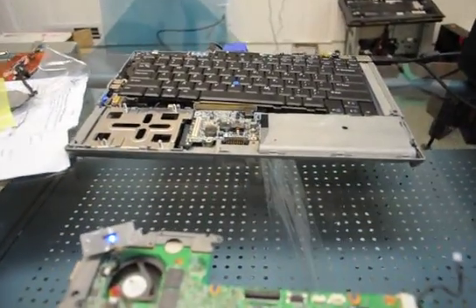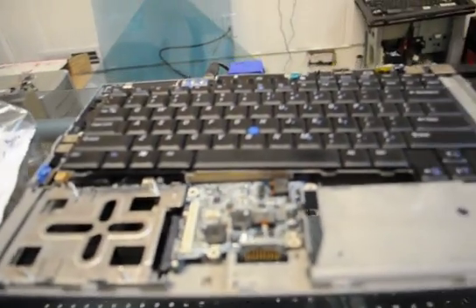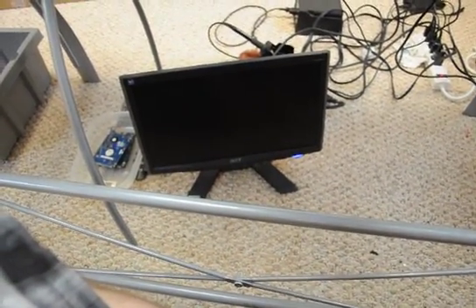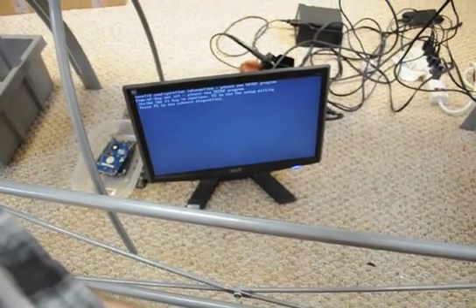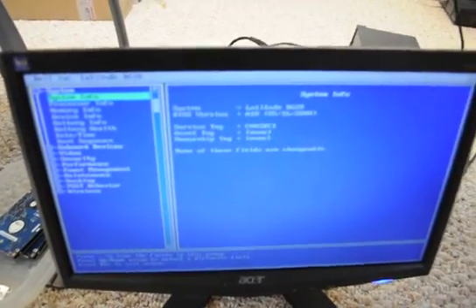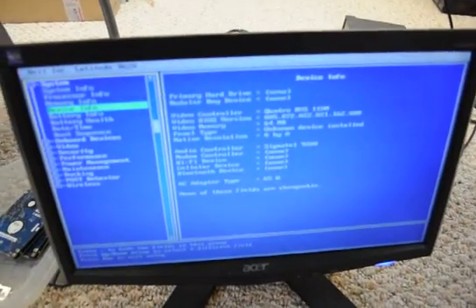What we have now is the Dell series laptop, so we'll run the burn-in simultaneously with the other HP. What we're going to do is turn it on. We did it just like we did the other ones to make sure everything was fine with it, and now we've got it to turn on. What you don't want to do is touch the keyboard. So we'll get this to start up into the BIOS — time of day and all that. It just started up, so what we're going to do is let it run the clock for two hours, and after that we'll set it as done.